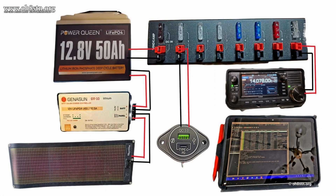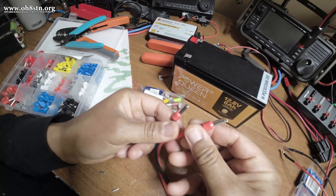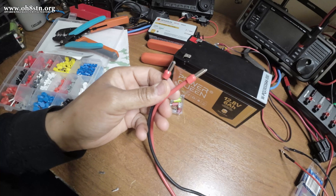Let's look at these from another perspective, thinking about everything starting from the battery. The plus and minus of the battery are connected to the battery input on the charge controller. The solar input on the charge controller is connected to the plus and minus on the solar panel. Additionally, the plus and minus of the battery are also connected to the plus and minus on the power distribution input. One of the outputs on the power distribution board connects to the radio and to our USB-C power delivery adapter, which connects to our tablet. We could further simplify the system by replacing the power distribution with a custom cable harness that only has the I/Os we need — but we'll leave that for another video. For now, let's get things wired up.